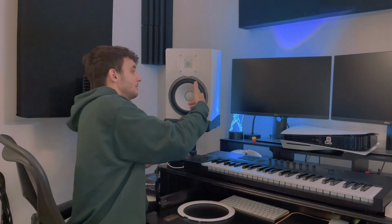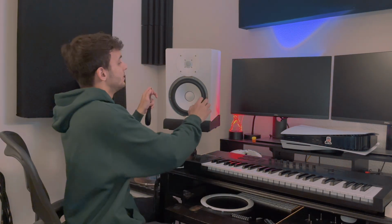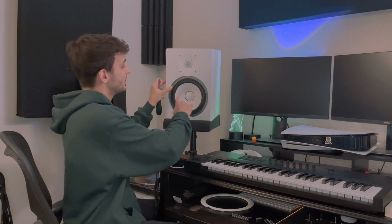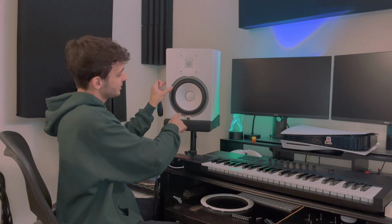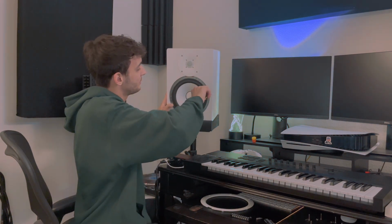One thing I would advise you guys is to use a hand screwdriver rather than an electric one, just because sometimes the ones you might have are too strong and you don't want to lose control of it and poke a hole in here with the screwdriver. There is actually a video where a guy did that, and we don't want that to happen. One thing I like to do is placing the screws back one opposite the other. If I place one right here, the next one's gonna be here, then here, always crossing each other, but just make sure everything's tied up.